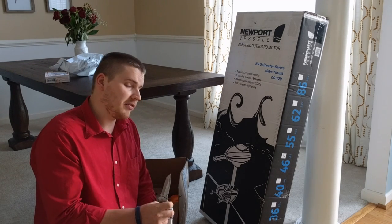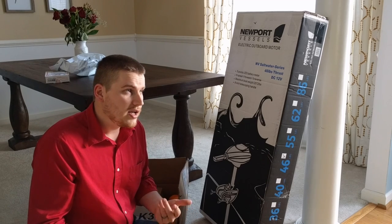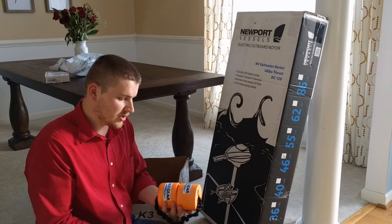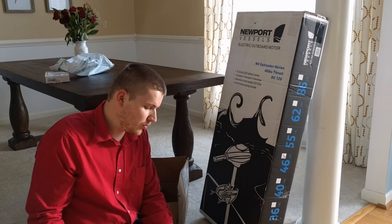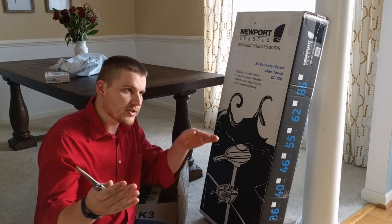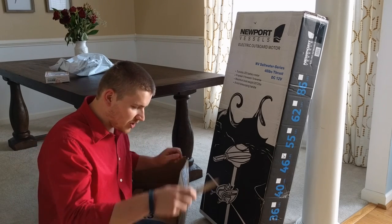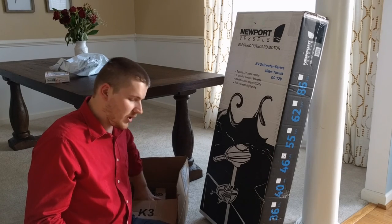This one has holding power in the sand, whereas the other kind can keep dragging and you'd be moved off your spot. Since I'm going to be in a heavy tide area, I needed a quick release system — I'll include a couple of links. It's called a QRAS, which stands for Quick Release Anchor System. Basically, you attach your anchor to a float that attaches to your line and floats in the water. You have another line to your boat with something called a cam cleat, which holds the anchor rope. If debris hits the line or the tide is too strong, instead of getting dragged under, you just pull on the rope — it releases off the cam cleat and you're free to go. Then you circle back around, pick up the float, and you have your anchor back without any further issues.